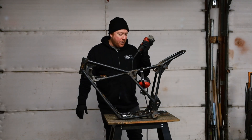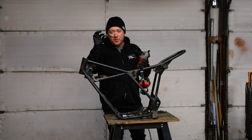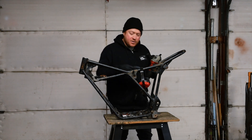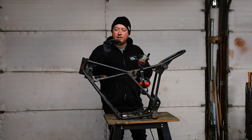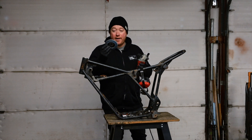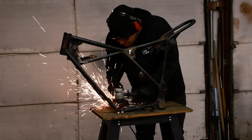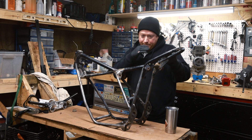To cut off all the tabs, the best tool I found is an angle grinder with a cutoff wheel — they're really skinny. Do not grind with cutoff wheels because they will shatter, so just use them to cut tabs. Then to smooth it up, I use a flap disc which works great. This is an 80 grit — it lasts a while and then turns into like a 240 grit for polishing.